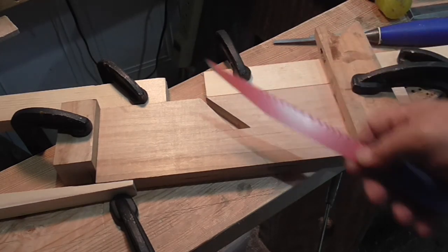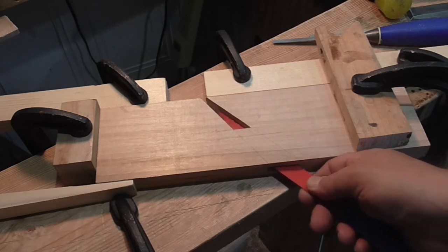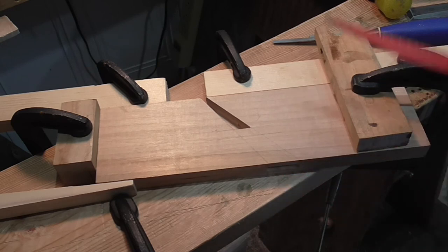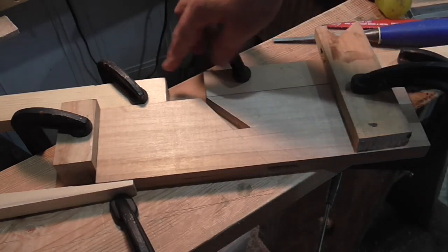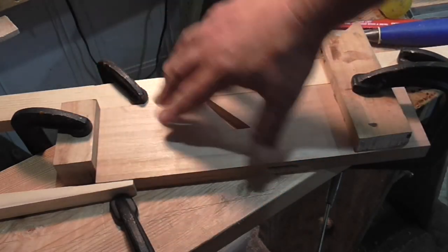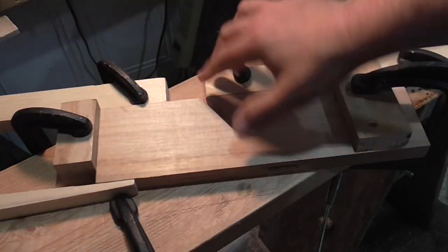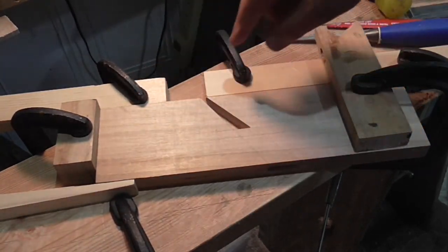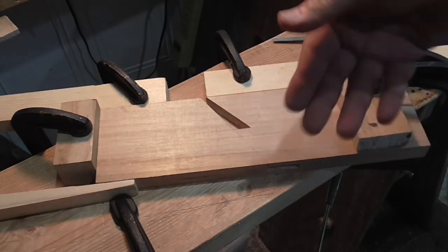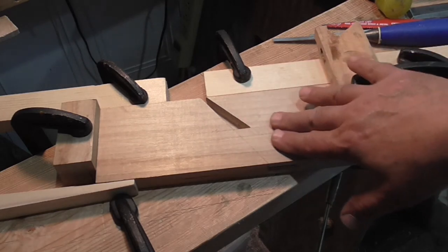It's tedious, but this is going, I'd say, almost at least a third to a half again quicker than the first one. I also set up a little jig on the table to clamp it. It's only being held down by one clamp. The rest of the clamps are just to capture it. And I have a little wedge here to keep it from bouncing. So it's just to trap it in this area so that when I machine it, it doesn't flip around. Like I said, it's tedious, but as you get into it, the details reveal themselves.